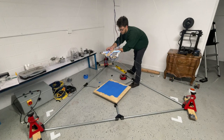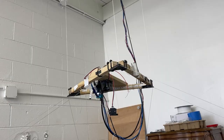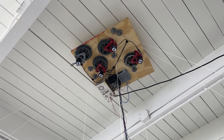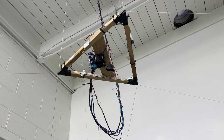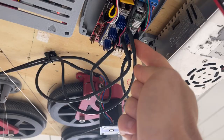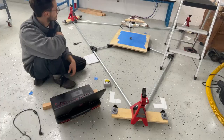So after setting up the base, I noticed that there was still a problem — the sound of skipping steps. So apparently there was still something wrong with my printer somewhere. At first I thought it was a bad motor controller, maybe it wasn't outputting enough power. I tried to fix that and then I burnt it, so I had to buy a new one. After crying for a little bit, I realized that the problem was in the software and it was in my units per steps.